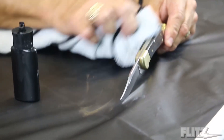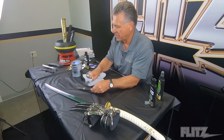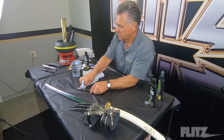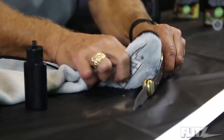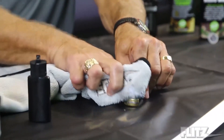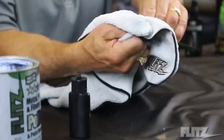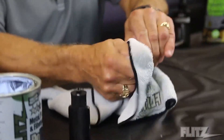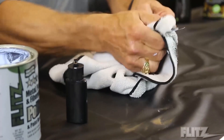I'll do the back of the bolster the same way. Once Flitz is in a cloth, it's almost impregnated — you can see the black residue. I put it on and buff right off. Now, if you notice, I put it over the wood, over the brass, over the stainless steel, and also nickel. When you take a knife such as a Case — a good collector's piece — Case uses a lot of nickel in their cutlery. You can see all the black residue it pulls off, which is fairly common when you're doing brass, stainless, and nickel. Once that's off, I take this cloth and buff it.